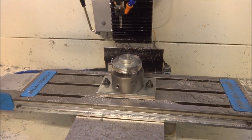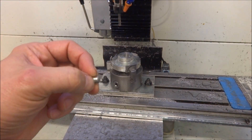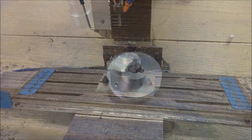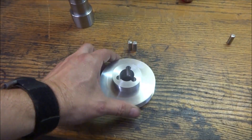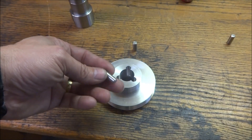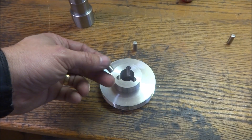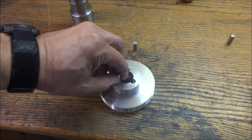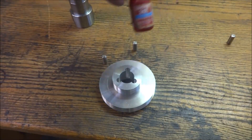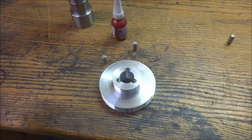Let's get this out. These are going to have to be trimmed down, so I'm going to trim them and face them on the lathe, then we'll press them in. The pulley turned out really nice. These pins are 5/16ths and they're 1-inch long, so I had to cut them down to about 0.770, and they're just going to press in. I'm going to use a little bit of blue Loctite just to make sure they stay in there. So now let's take it over to the press and press them in.